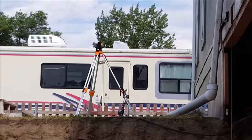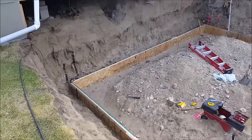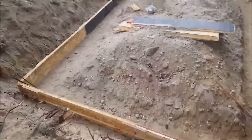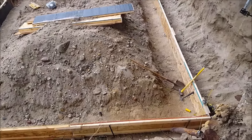To take these measurements I am using my builder's level which is located up on the ground level surface. To secure the concrete forms to the ground I'm using some concrete steel stakes that are three foot long and five-eighths in diameter, and I'm placing these stakes about every four feet on the concrete forms, making sure to drive them into the ground at least 15 inches.